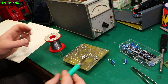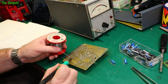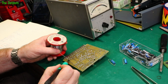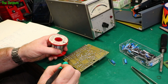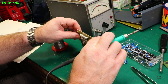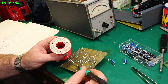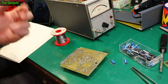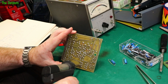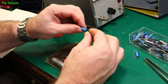Let's recap the board. I'm going to put some fresh solder on these caps here to make desoldering easier - it does make a difference. I'm going to take these caps out and replace them. I haven't tested them; I'll test them after I take them out. In-circuit testing can be problematic anyway, but these caps are 60 years old - it's not worth messing around. Let's just replace them and not have to worry about it.